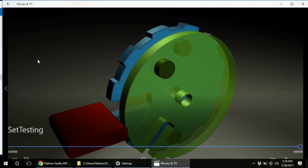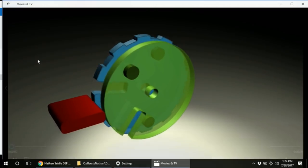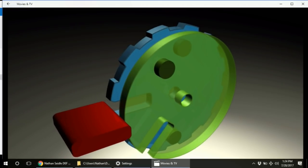I'm gonna play this animation again, but disk C is the blue disk. Disk B is the green disk. Now we have those interference points, right? To test as quickly as possible, I shouldn't reset all the disks. I'm a robot, I know exactly where the disks are, so I shouldn't have to reset B. I tested C, and now I'm going to turn C until it interferes with B. B will move 3 digits, and then C returns to where it needs to be, and we test again.